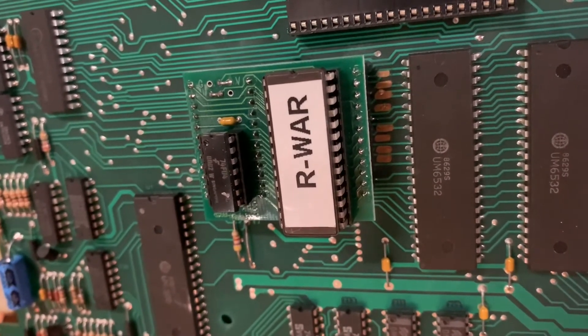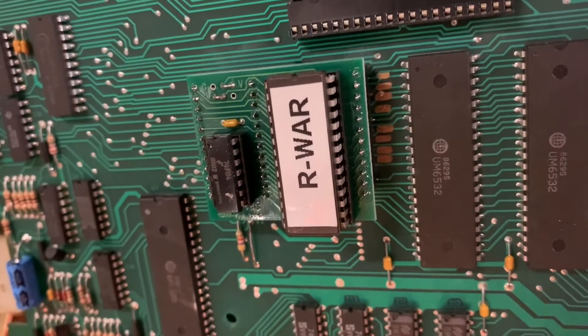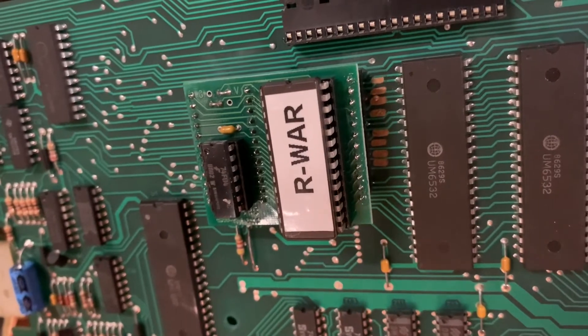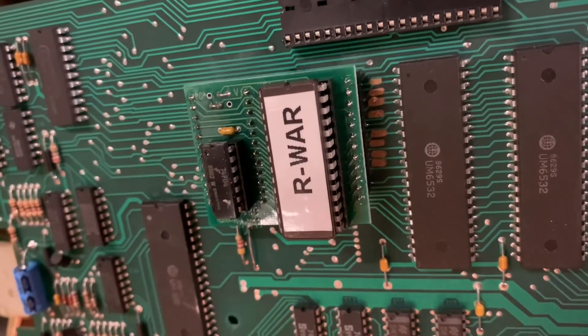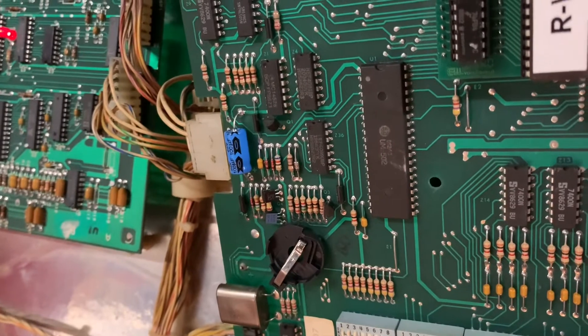What I do is replace the OEM card with one of Ed's from Great Plains Electronics aftermarket boards. The advantage of Ed's board is that it creates redundant connections between U2 and U3, so even though some of the eyelets are torn up on U3, it makes a connection to the game PROM via U2. Really nicely engineered.